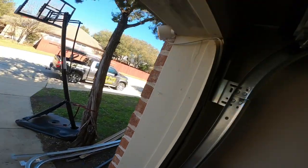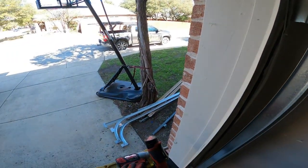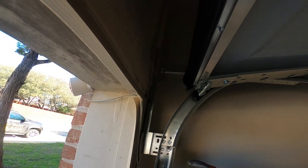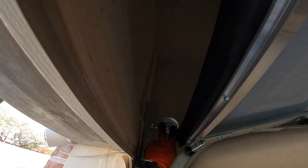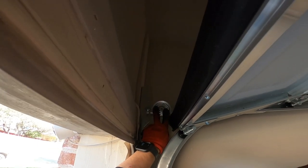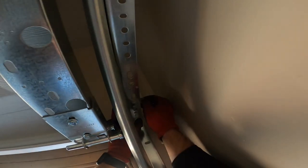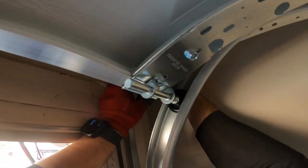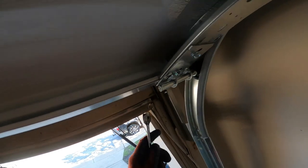So basically they're gonna go, make sure this thing's good. Right up here, what you wanna do is put it in a slot where this wheel clears the flag bracket up there. So it looks like the second square hole. Get a washer ready, put the bolt through that little pulley right there, stick the washer on. Hold on, I gotta take my gloves off, too big and bulky. So stick it through, stick the washer on. Then the nut and tighten it down. You need a 9/16 wrench to hold them.